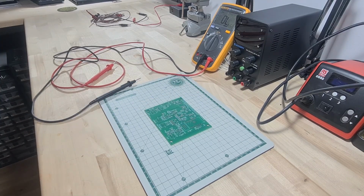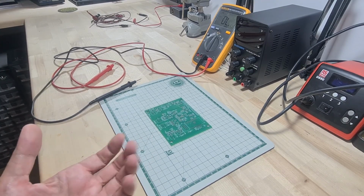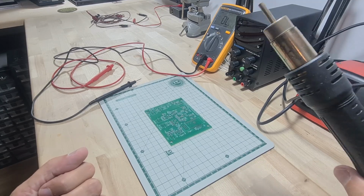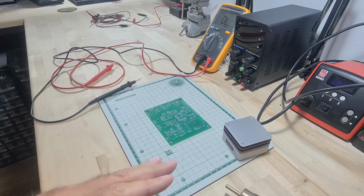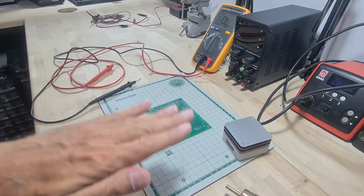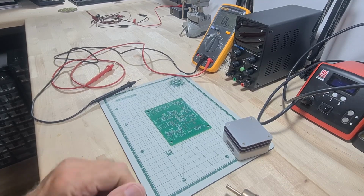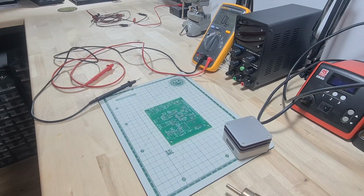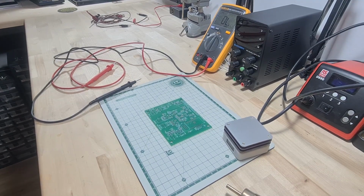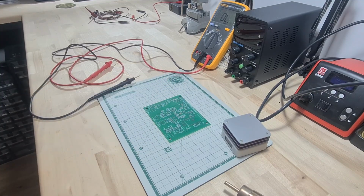But you can't apply the solder paste to just a section of the board. So I'm going to have to do the whole board and then bake it with either the hot air gun or my cute little hot plate thing. That way all of the pads will basically solidify with their amount of solder on them. That's not the best way to put the secondary and tertiary components on later, but it's the only way this is going to work with me doing the board one logical section at a time.